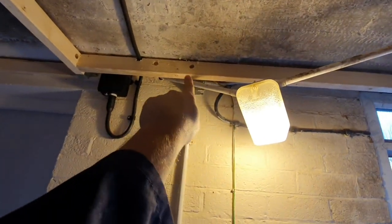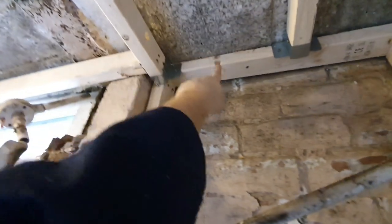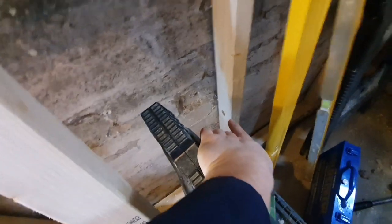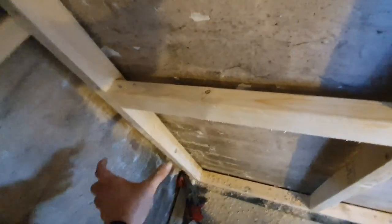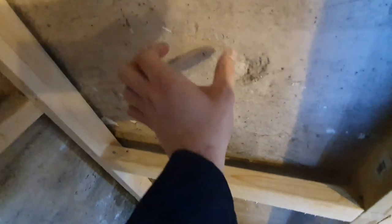As for the power, it comes from this one, clip across there, through this little hole, in round through here, through this hole that I've punched in, down through there, into this section. Maybe put a socket in there and then go across through that one, through that one, through that one, and so on. Run it all the way around, which I can then drop in through this section, pull the cable up the back of here, because I've turned the timbers this way to fix the base units in. The cable can run straight up here into a plasterboard box — that's what I'm using, so I don't need to put any boxes back to this.